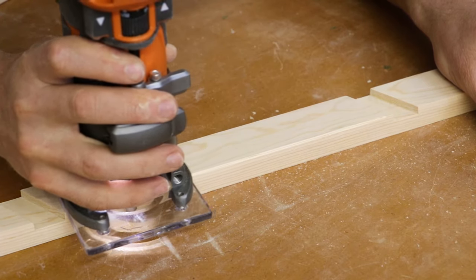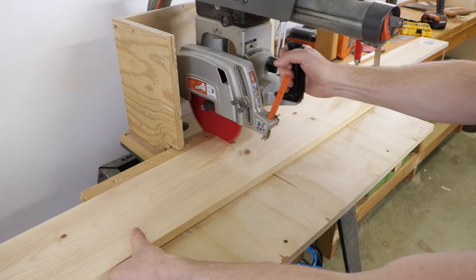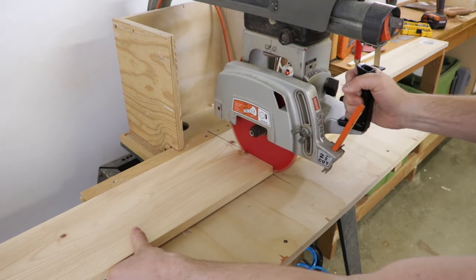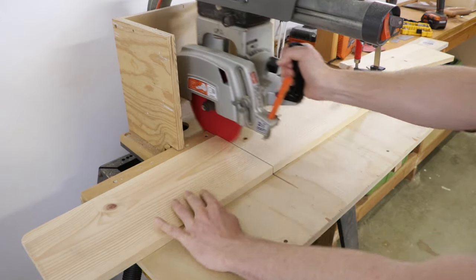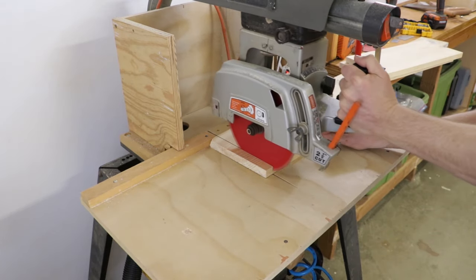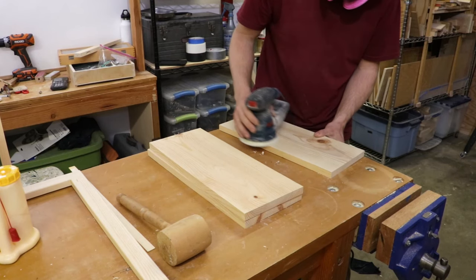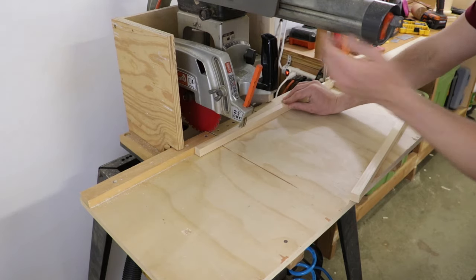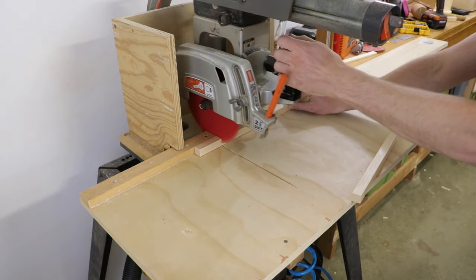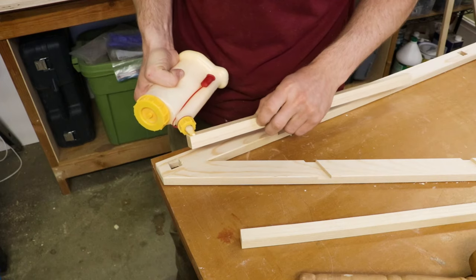The design of this project was influenced by the wood that I already had on stock — I didn't want to go back and forth to the home center, so I just picked what I had and drew it up in SketchUp. Here's a seven-and-a-half inch wide board cut into three approximately 18-inch increments. I also had some three-quarter inch square dowels on hand from a project I never finished — these would be perfect for the stretchers as they'll fit right into the mortises.